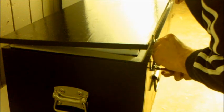Get your Phillips screwdriver, and using 3.5 diameter wood screws, they're about 60mm long, you're going to screw on the brackets, like so. So feed it in first, and then carefully. Now, I always drill at 1.5 diameter, so the screws will bite in there. It's quite tight, but that's exactly where I want it. Reasonably tight. Okay. Keep putting all the screws in place, like so.